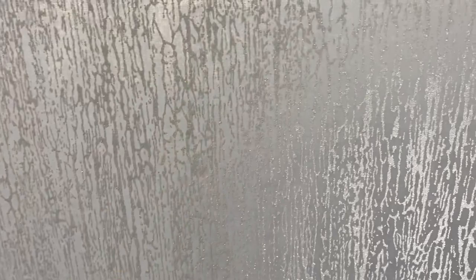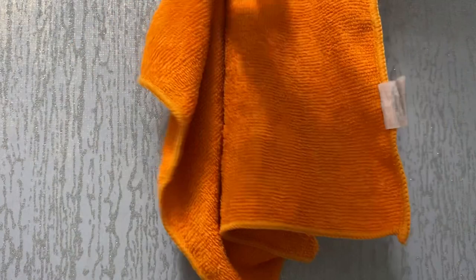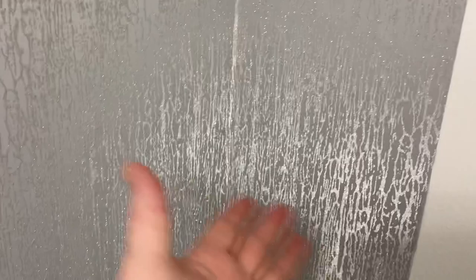If you don't like dabbing glass beads wallpaper with a damp cloth, you could use an alternative tool. After cutting that piece and putting this piece into the corner, you can see how beautifully it fits. If you cut it first, there are no wrinkles. If you were to take the whole piece and try to install it, you'd have wrinkles all over. The paper is very unforgiving - you'd have all of that shining back at you from wrinkles down there. So cut your corners to avoid them.